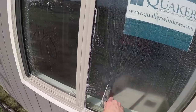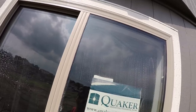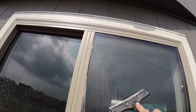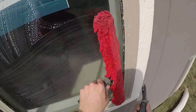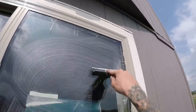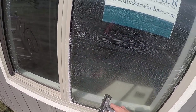The first thing you want to do is wet down your window. Use nice even strokes, making sure the blade is flat on the glass. I usually work one side of the glass, working my way up, then over, then down, and then get the center. Make sure to always blade wet glass in single strokes — that means never go back and forth on the window. This is how you can scratch the window.